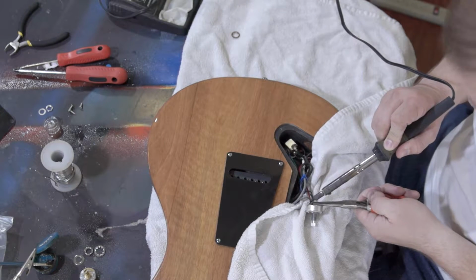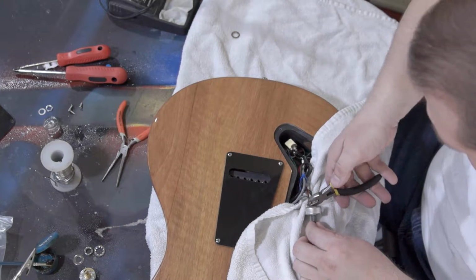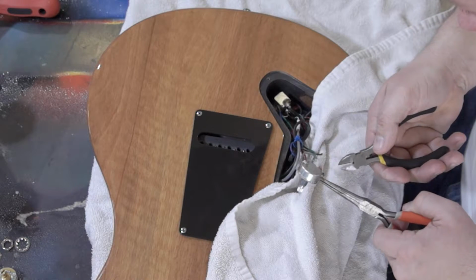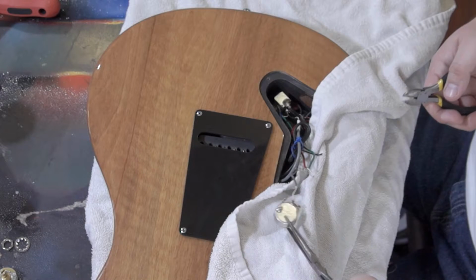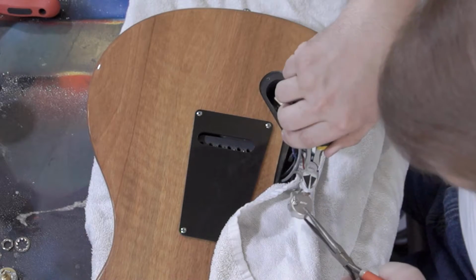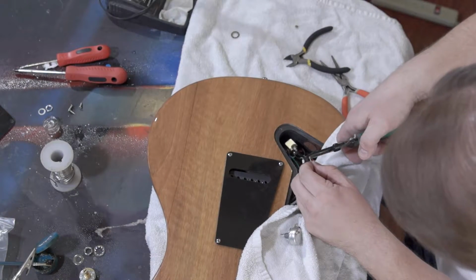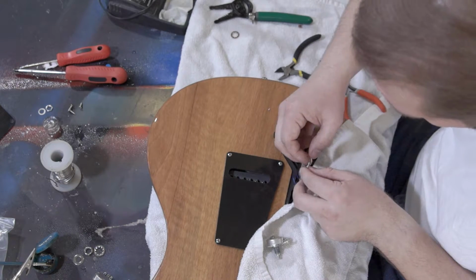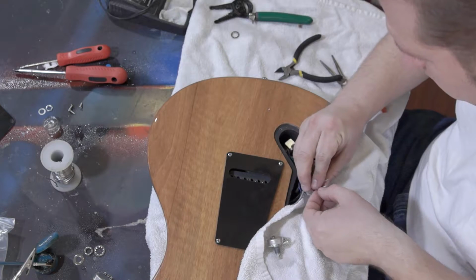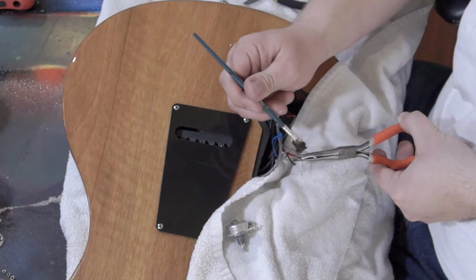It appears that my soldering iron will not get hot enough to melt the solder they used. Plan B. No, the wire's too tiny for my strippers. These all together. There we go. Okay, flux. Don't even bother if you don't have flux, because you will hate yourself.